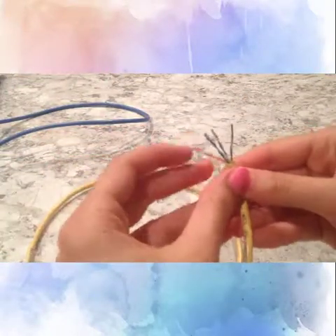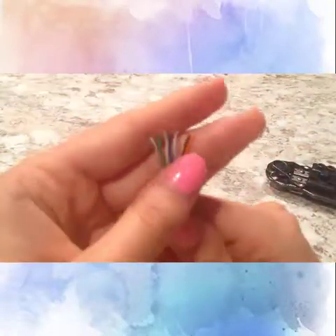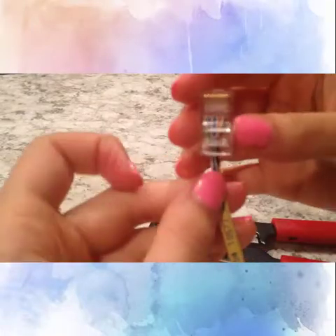On to the next cable. Now this cable is going to be a bit more tricky — it is going to be called a crossover cable. One side of it will be exactly like the straight-through cable using the pattern I showed you earlier, and the other side of the cable will have a slightly different pattern to follow, which can get confusing but is very necessary in the process. So I'm going to start off unsheathing my cable and taking off the little cover on it. Once I do that, I'm going to neaten up the wires, pull them apart, and make sure all the colors are visible. I will then put it into the straight-through position as I did earlier, straighten out the wires, trim them down to an even length, and then insert it into the clip and crimp it again as I did before.